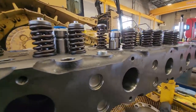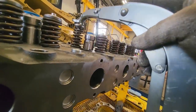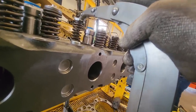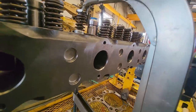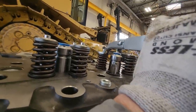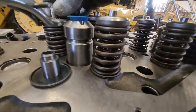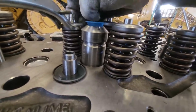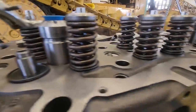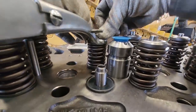To make the customer happy, CAT and Western States are doing the best we can to try and make this engine happy while it's still under warranty. I got a lot of comments saying you need to check if the piston rings are upside down or various other things. But it was determined that we need to stop here — there's no signs of cylinder damage, so really no reason to go much farther in, especially on a dozer where getting the oil pan off is a huge pain. You can see I'm using some high vacuum grease — it helps hold the keepers in. The keepers will not always stay there if you don't use something to retain them. I've heard people use Vaseline, that'll probably work too, but I like the CAT high vacuum grease.